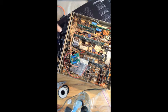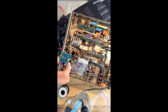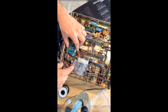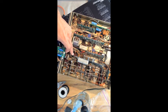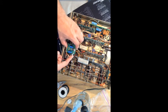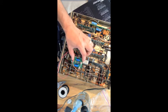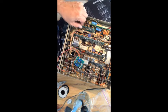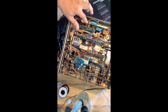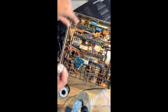We are back — I'm getting ready to install the Amp4 from Sherwood Engineering. It goes right here, and since this has already had the 600C mod done right here, it provides a little hole to install your holding fixture. If you don't have that, you're going to have to drill a hole — the instructions show you how. Basically you're wiring it to the phono jack and to the wiper of the gain pot. I've already disconnected the original audio driver, which is right here. This is the final here, and I have to remove the driver — Q10 has to be removed.